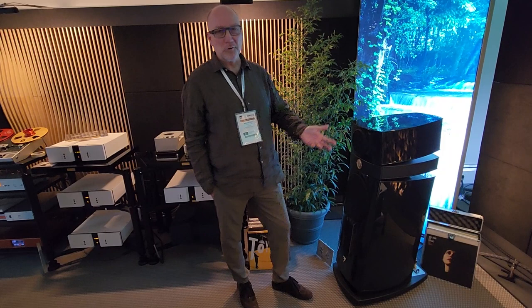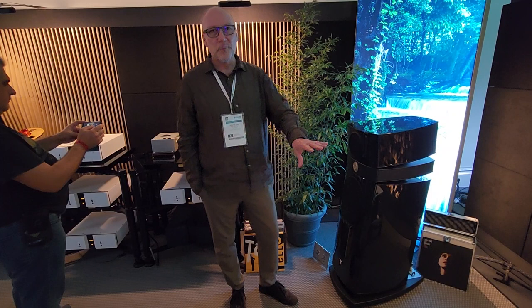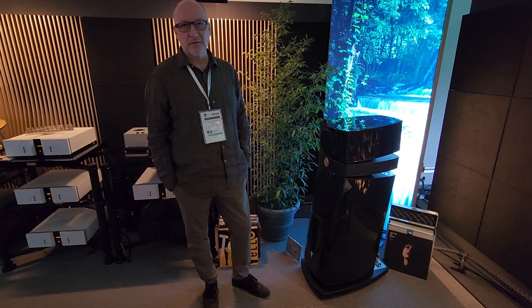Capacitors and other components, they don't like that. Yeah. So we have Class A 100 watt products, the predecessors of these being in the field for 18 years. And we haven't seen any for service or anything. So without any kind of tracking bias, how do you keep it cool? You just have so much heat sink? I totally over-exaggerate the heat sink.